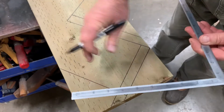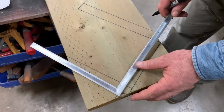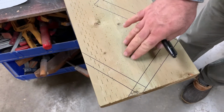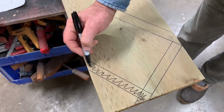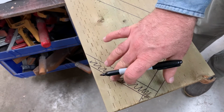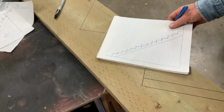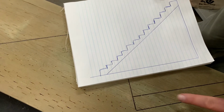And maybe these stairs go down into a basement, and they're going to fasten to a concrete floor. Well, that's going to be somewhat lower than the finished floor. So you need to extend the stringer to make allowances for that, because this is going to be the finished floor, and that's what works out in terms of geometry. But the stringer will actually be sitting on a floor that's below the finished floor. Another thing you need to be aware of is what's happening down here at the bottom, and this drawing here shows the bottom.